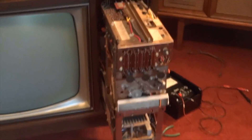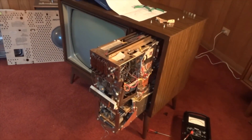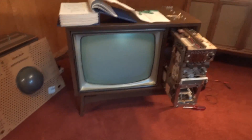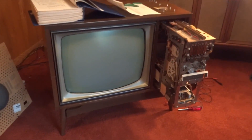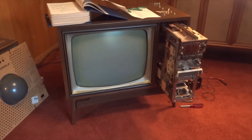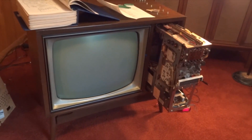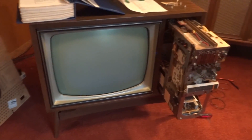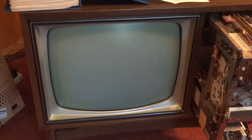In this video I'm going to share how to disable the instant-on feature, which was typically found on these sets. Instant-on provided the viewer with the satisfaction of an instant picture the moment the set was turned on. This was achieved by having a constant lower-than-normal operating voltage applied to the CRT filaments at all times, even when the switch was turned off. Once the power switch was turned on, a full 6.3 volts was supplied to the CRT filaments, and since it was already preheated, the picture would instantly appear.